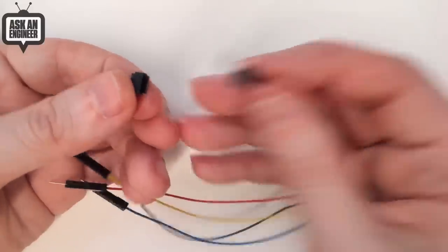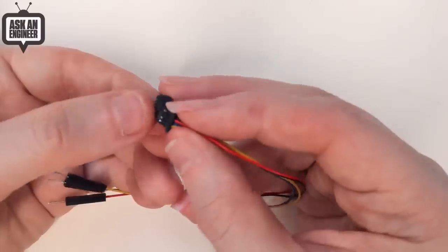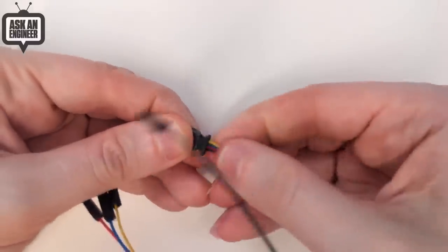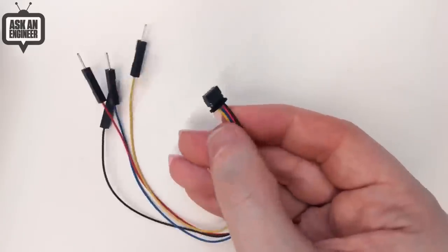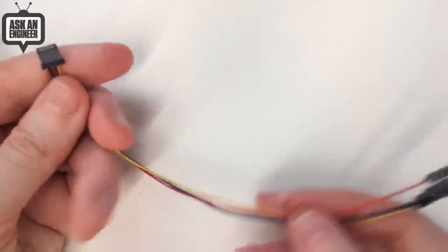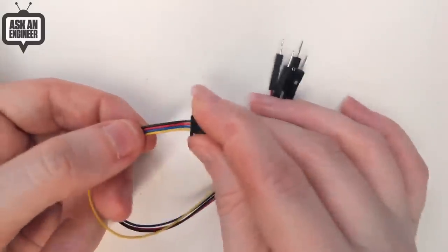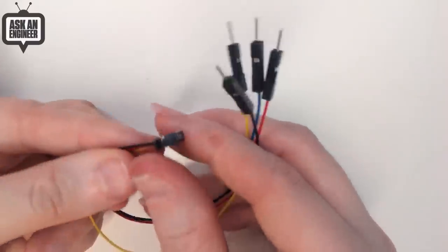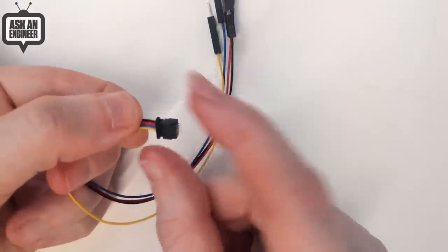But yeah, so this cable is like a Qwiic cable using the JST SH, and this is the connector. It's a snug fit, but it's not too hard, except if you get it in upside down. If you put it in the right way, it just fits in very snugly, and you get power, ground, and then 2 data lines, which they use for I2C data or clock. You don't have to use it for I2C. You can use this for anything, but if you want to match the Qwiic standard, then you should match the colors to the capabilities. And then just solder this in. You can solder it with an iron with a fine pitch tip, or if you're pick and placing, of course, it's not too bad either.